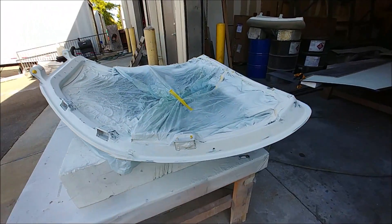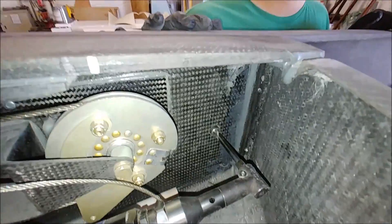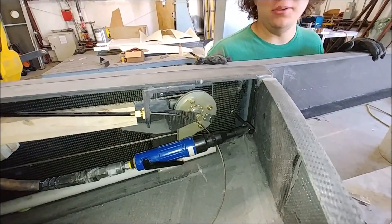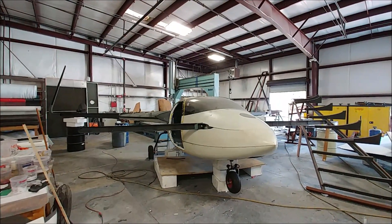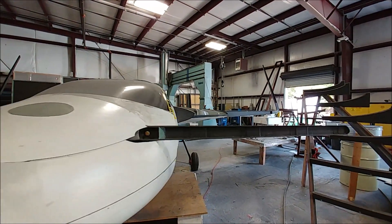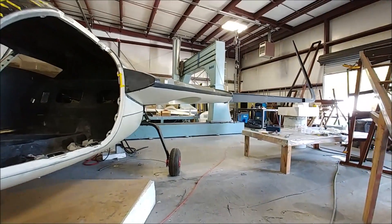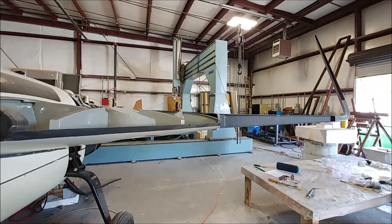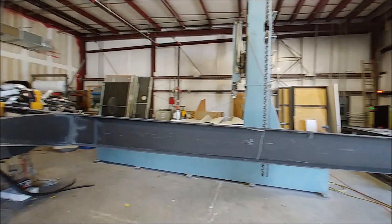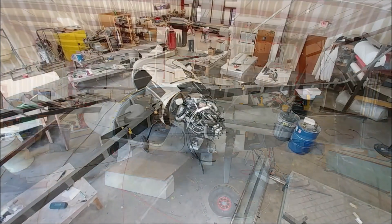The next job with the wing spars was clamping them into place, making sure they were correctly aligned, then match drilling the holes — drilling from the existing hole in the main spar onto the wing spar. I'm doing that with a right angle drill and a little bushing. Here's the fuselage now with the fore plane spar bolted into place and the two wing spars clamped on. Don't get too confused by the inboard rake angle of the winglets — the camera angle is over-emphasizing it, they're only inboard by a few degrees, and the wide angle lens accentuates it further.